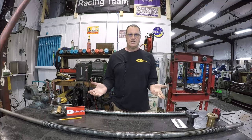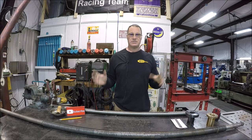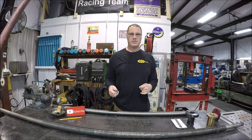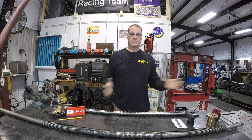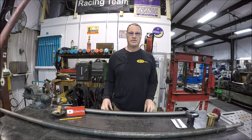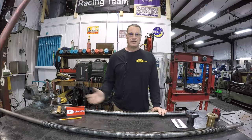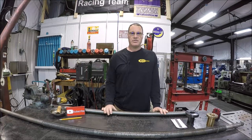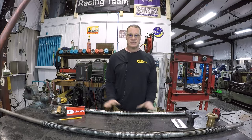You think that the saddle and the table itself are what, 1,500 maybe 2,000 pounds alone, just sitting there on the ways, and then you slap on a couple angle plates and a big piece of work, say another 1,000 to 1,500 pounds. So you could be moving 3,500 pounds, 2 tons, back and forth constantly. That's what wears this thing out. So going with a ball screw and a ball screw nut, we're not going to have that issue. It's going to be nice and smooth, and we don't have to worry about backlash, excessive wear, anything like that. So that's what I've done.